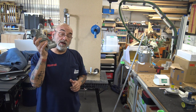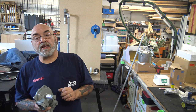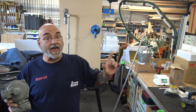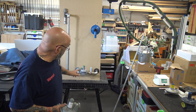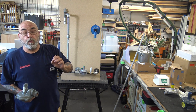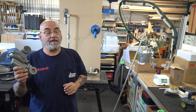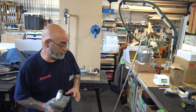The reason that we go to this one is for generators. Generators take a lot of gas. And there's also a specific distance that the regulator has to be from that appliance, and we're going to go over that in a second. But one of these regulators, a Pietro, or even one of these regulators, will not provide enough gas to that appliance. And with a generator, yeah, because generators are almost 500,000 BTUs or better.